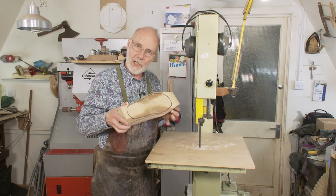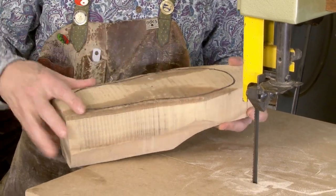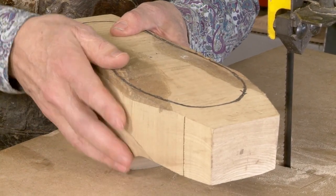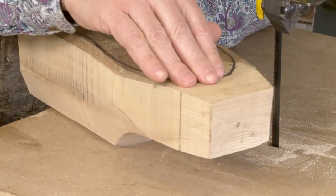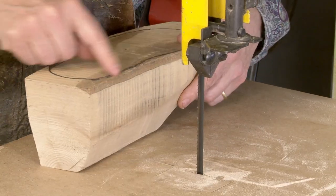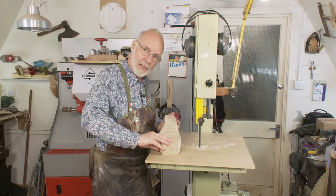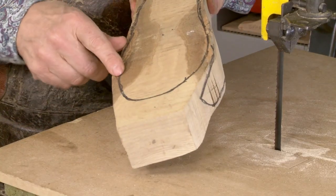What I'm going to do now is cut out the outline around here, which seems easy. But if you have a look, you'll see that the wood leaves the table under here, so if I were to cut out here it would bang down. So I'm going to cut in the outline from here around to here where the wood is solid on the table, and then I'm going to show you a trick of how to cut the outline from above even though you can't see the line.